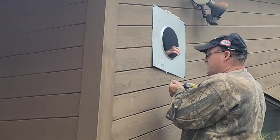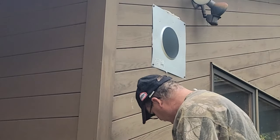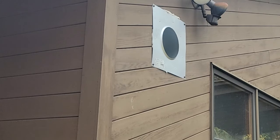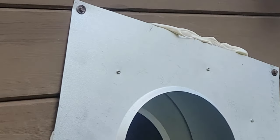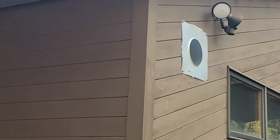Now you take your inside collar and slide it over there — see if it fits right over it. It should. Fits right over it nicely. Let me bring the camera up here to see that. Say hi, Dawson. See how that looks in there? That's going to be fireproof right there, and it's going to be two inches plus from any combustible. I'm going to clean up the caulking and put more screws around the perimeter. I got that screwed on there — it's caulked with two rows of silicone at the top underneath, and all the screws with gaskets around. Let's go on inside now.